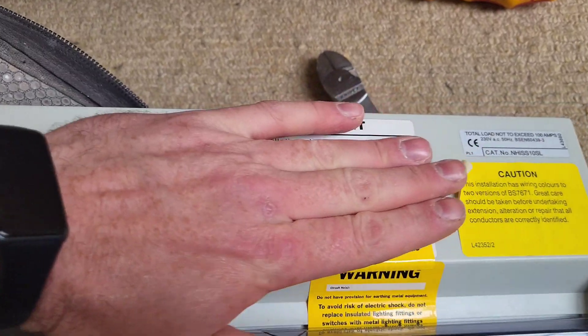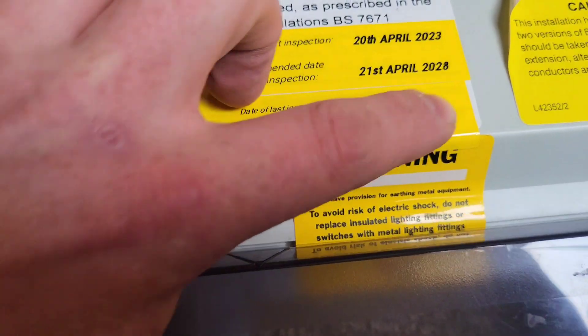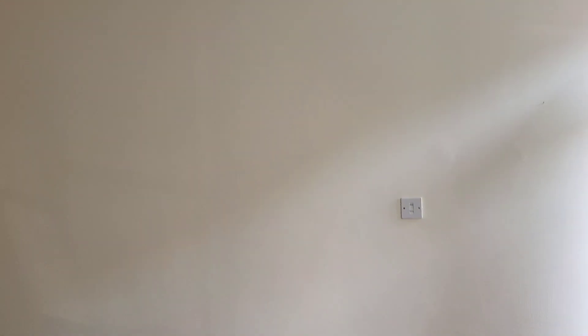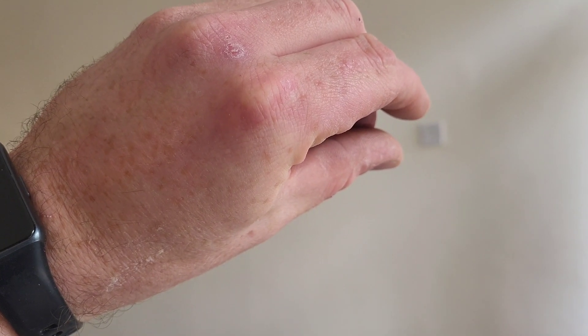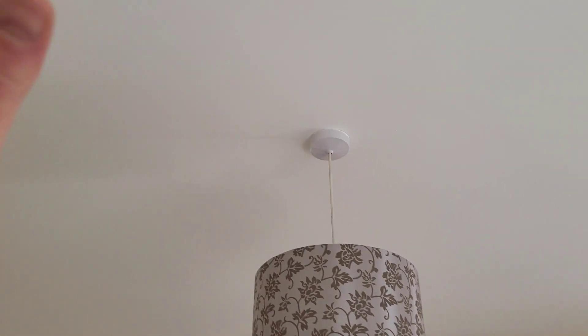There's actually no earth provision on the lighting circuit. But there are stickers we put on last time — 'unsatisfactory report, remedial work required, 21st of April' — and it does say on the sticker provision for no earth. However, on further inspection there is an earth but it's just been poorly terminated at the light switches — literally about 10mm of earth wire coming through from the top of the box into the switch.